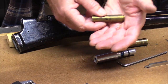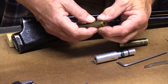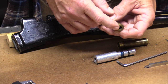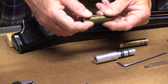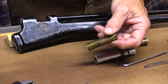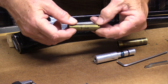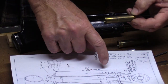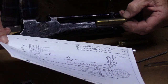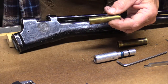Here's one that actually has the groove cut in it — you can see it right here. It takes a number 111 O-ring. I had the opportunity to measure probably half a dozen of these grooves, and they ranged from about 95 thousandths to 102 thousandths in terms of width. The specs say it should be 105 thousandths plus or minus 2 thousandths, so 103 to 107. None of the ones from Crossman met their own criteria.